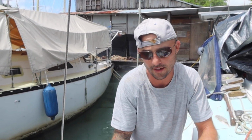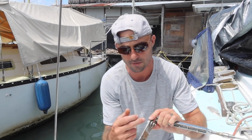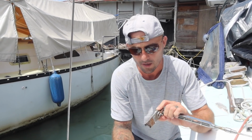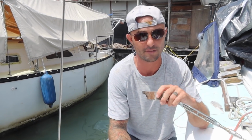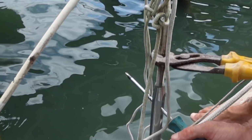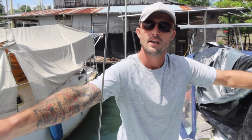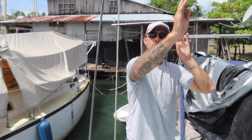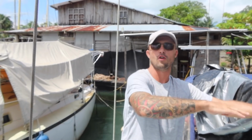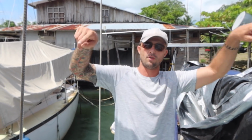It is, you're finding it here when it's in the safe spot. I mean, this amounts to replacing these chain plates, which is really about probably $100 US per chain plate. But you got to do it. You're so glad. You don't know it yet, but you are so glad that you did this here and looked at this now. What we can do is we can loosen up that mainstay over there a little bit, so it's not pulling so hard that way. Okay. That way, if it does, because a mast, even with just forward and aft supports, won't fall over unless it's really windy. But it gets windy here at night, so you want to have a support this way.